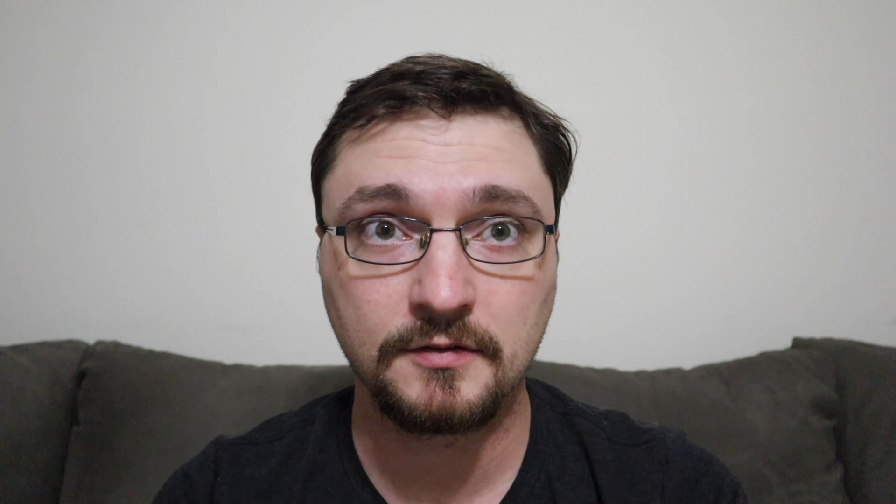This is where things started to go off the rails. To help you understand a little better where we went with this problem, let's go take a look at a 3D model we made to help explore possibilities. So here's the 3D model we made of the original Avid fuselage as it was when we received it. There are a few unimportant parts like the vertical stab and the motor box that we haven't actually modeled because we don't need them. What this shows us is how the structure comes together and the amount of room we have to work with in the cabin. Let's take a look at the side view to see how I do, or more to the point, don't fit in the airplane.